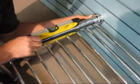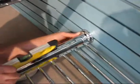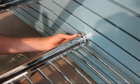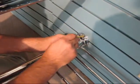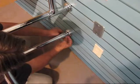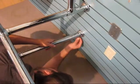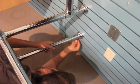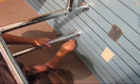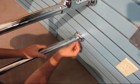And we've set a level on our left shelf support. We've ensured that all clips are resting properly on the shelf supports, and we're marking out that last wall flange. We are now securing the last wall flange and horizontal cross member, the lower left shelf support. Again, that's tightened with the set screw supplied, and the wrench is supplied as well, and we've located the set screw to the bottom of the wall flange.